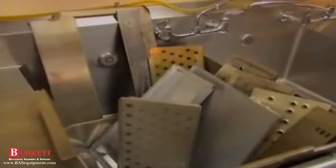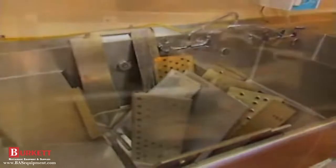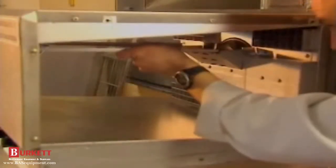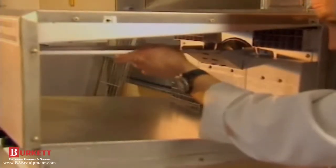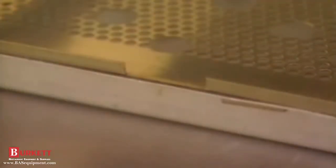The parts you washed should be dry by now, so let's reinstall the air return baffles and put the fingers back together. Reinstall the top and bottom air return baffles in the proper locations. With the outside metal lip facing up, nest the columnating plate securely inside the finger housing with the small notch toward the narrow end of the finger housing.